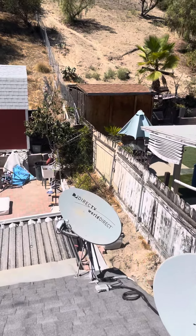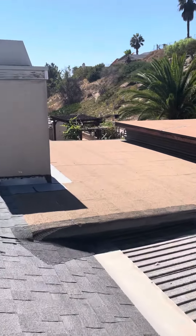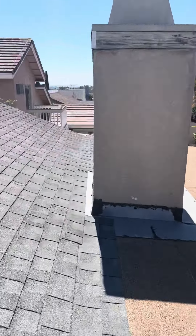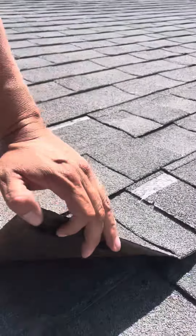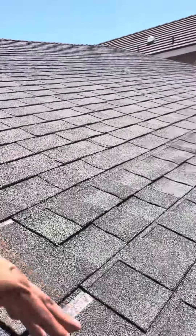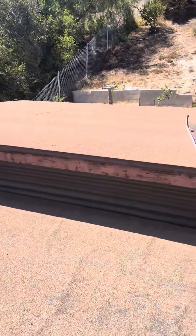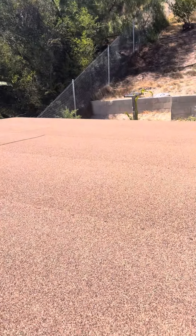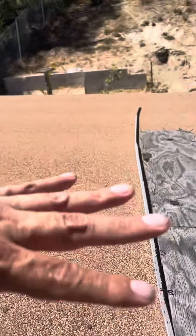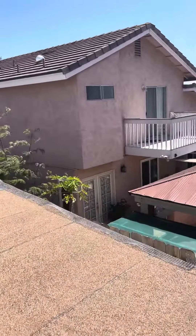Over here these gutters are not working — we can actually tear them off and throw them away. Here is an area where they tried to fix and probably nailed it down. On this flat area I would suggest doing an overlay — an overlay on this torch-down TPO, because you've got exposed nails in there. I would recommend doing an overlay of TPO on this area.